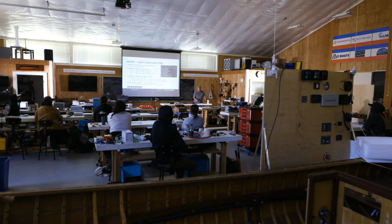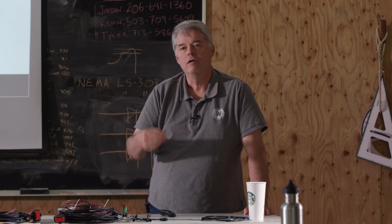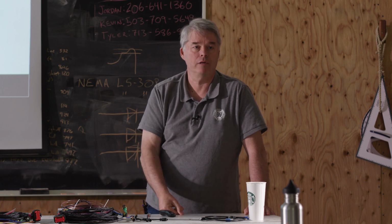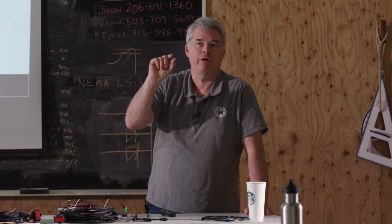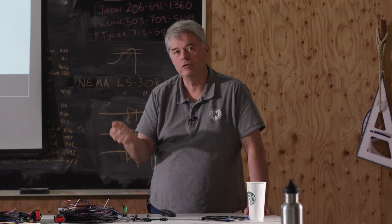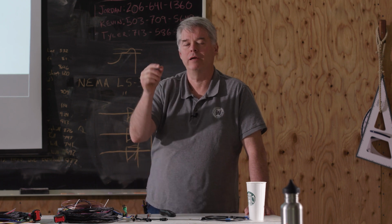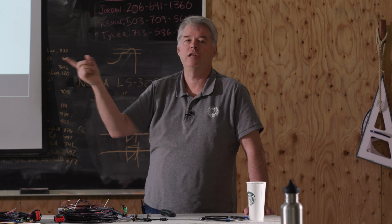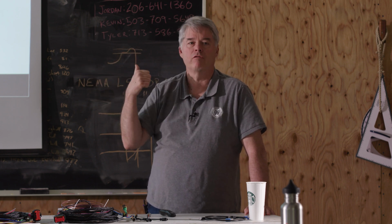What happens if you make a typo? Does it just break the device? It's a very good question. There is very limited range checking on every one of those parameters. If you make a typo and the parameter is out of sequence, you may end up with a misconfigured regulator. If you make a typo in the range, we basically on every parameter will do a range check, and that's documented in the ASCII comms guide. If you're outside of that range, then the regulator will throw a NAK.